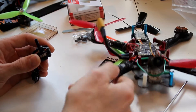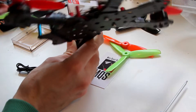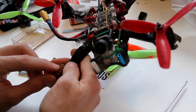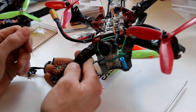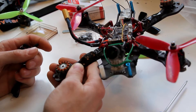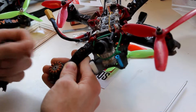If you look at these other competing motors — for example, the 2205-2350KV motors from RCX — these are my go-to motors that I tend to use all the time. I really like them and I'll keep using them. They tend to have much thinner wiring, and to make the same number of turns and maximize copper fill, they use multiple thinner strands together, just wrapped all the way around. I think the reason they do that is because the manufacturing is just much easier — you can essentially mess up with thin wires, have them go all over the show, and they'll still fill up the space nicely.